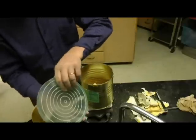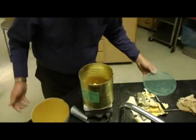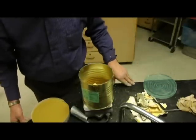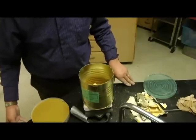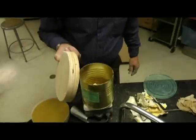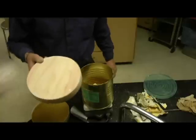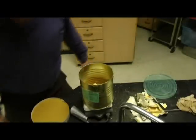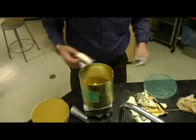These are tools that we've used to grind 8-inch telescopes with in the past. I like to use them on a tool because as I reheat it, the glass takes the heat better than wood. You can actually do it with a couple of pieces of plywood laminated together and put the pitch on top of it - that works just as well if you don't have an extra tool.